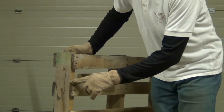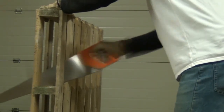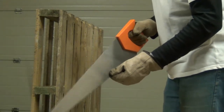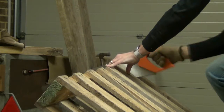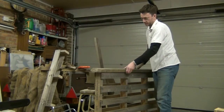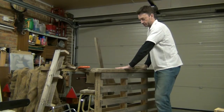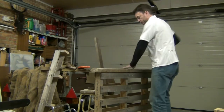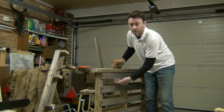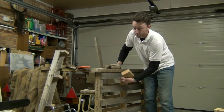So the first task is to cut off this pallet at the level of the second slat. Hopefully by this point you will have either a universal saw or a cross cut saw that you can use to do this. Now with the top on you can see the height we're talking about, and I think that will be fine. It will work well for planing and it will work well for sawing. To be able to clamp things to the worktop we really need a flat surface underneath here - at the moment it's just a hole. So we use these small blocking pieces of 2x4 just to fill up that area and bring it flush with the bottom of these two slats.